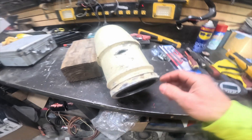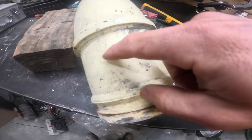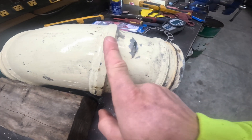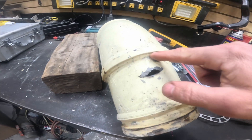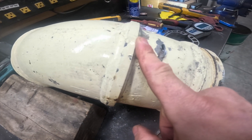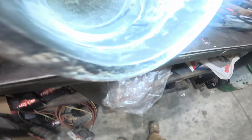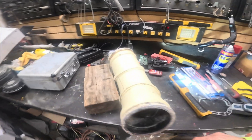So an otherwise nearly new elbow dished out in one little spot, and it's in such an interesting spot. It's not like it was hit with a hammer — there would be more damage to the paint and it would be dented in. With the raised flange, it'd be really tough to get a hammer head in there. My thoughts are: when this is welded — is this welded after the CCI liner is installed? If so, did the heat from the weld wreck the hardness of the CCI liner? That's why it came apart right here. It's definitely a little bit of a mystery. This is not a conforms piece, so we do know that.